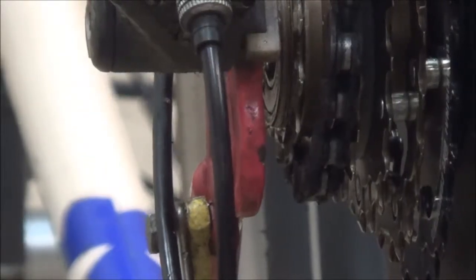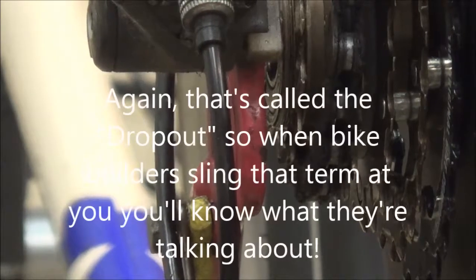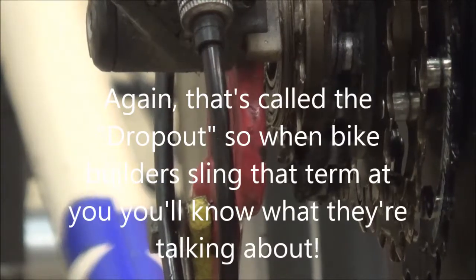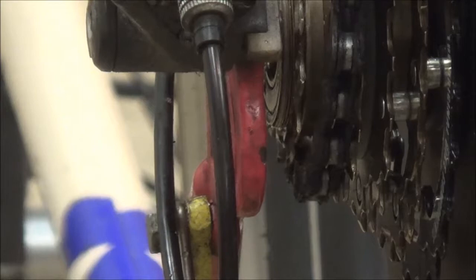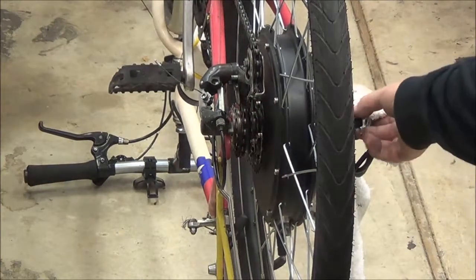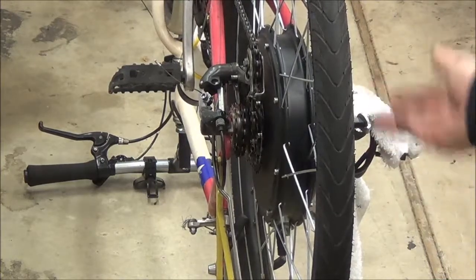Right in here, the gap — you can't see the axle from here, but there it is. The gap between the fork on the rear wheel portion of the frame and the flat of the axle are too narrow. I want them to be able to slip on and off easily. So what I'll have to do is take the wheel off, measure the flat thickness and the gap in the frame, and make them so that it can slide on fairly easily.